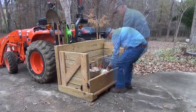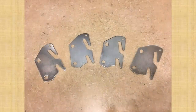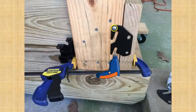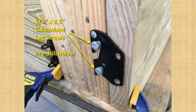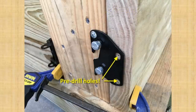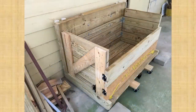The tailgate is nice to have when you want to keep your load from escaping the carry-all. The secret to the tailgate's quick-on quick-off is the use of bed claw hook plates — I bought a set of four on Amazon and painted them black. The small screw hole in the corner of the plates held the plate while I measured and marked where the holes needed to be drilled. A clamp holds the tailboard in place while measuring and installing hardware. Quarter-inch by two-and-a-half-inch long galvanized lag screws are used for the hook plates to hook over — pre-drill the holes with a 3/16-inch bit to prevent splitting. The lag screws on the side panels need to stick out about a quarter of an inch. Pre-drill the holes before installing the lag screws on the tailgate too. The bottom tailgate board needs one-inch by one-inch notches in the bottom corners to sit flush on the platform.